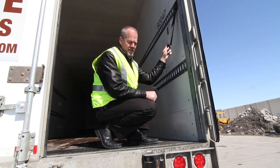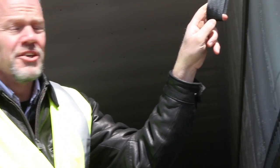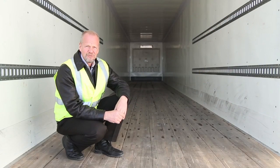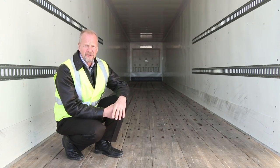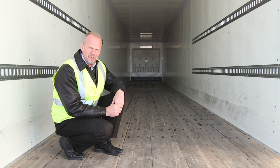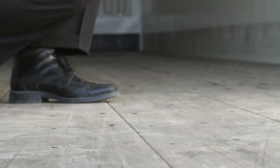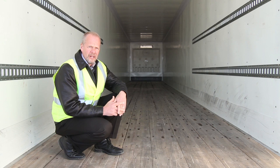In the interest of safety, we want to maintain three-point contact at all times while entering the trailer. We now have an additional strap for drivers to maintain that three-point contact as they enter. As we talked earlier about floor protection underneath, we've also added protection on top of the floor. The last eight feet of this floor has been heated up and then dipped in hot wax. The objective is to keep it watertight in the transition zone from outside to inside, keeping the floor free from wood rot in the working areas.